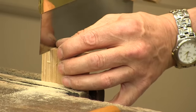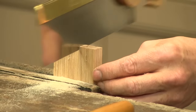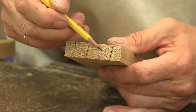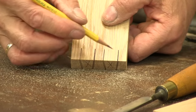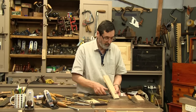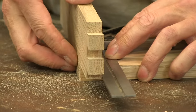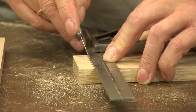If you're going off your cut, go back in the cut like this and just use the side of your saw teeth to correct any discrepancy. You can see which side of the line I cut on — this is the waste wood coming out. You can see I've left my lines in on each side, and you can see I've stopped short of the line each time because naturally the wood is going to split down that last little bit. Back to my square — I know the end is square because I checked it when I planed the end. My piece of wood goes on here, I flush it here with my fingertips, and then I go right in between here with my knife, in between the saw kerfs first.